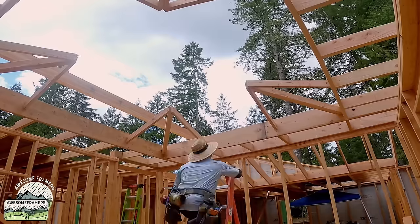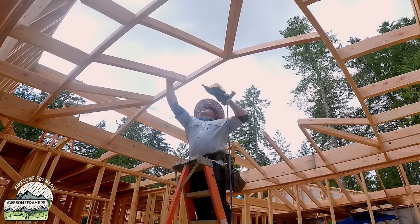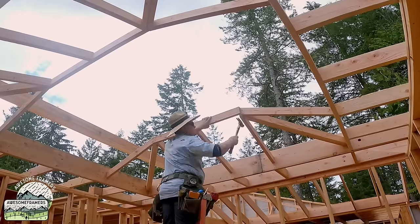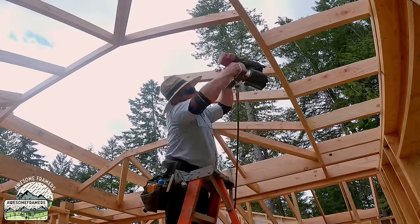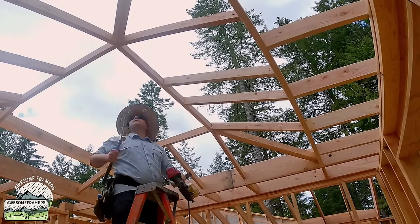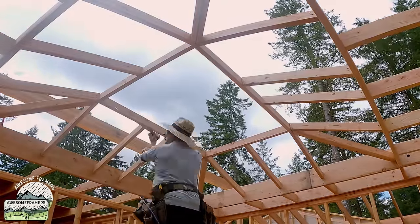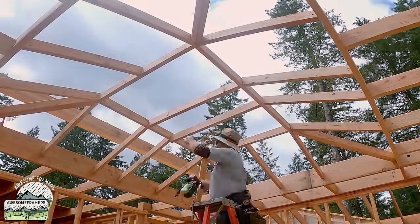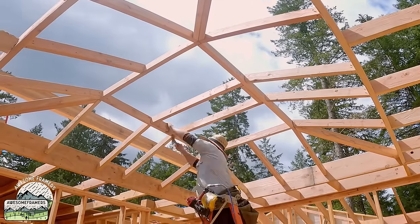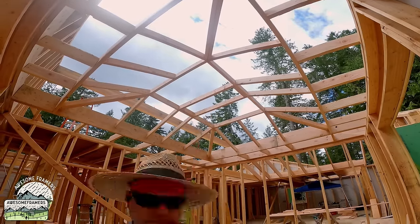Kyle was off for the day and everything was too heavy for me to do, so I framed the master bedroom ceiling. We call this a hip tray, easy one-person work. All of the components, the rafters, the hips, are pre-cut on the ground out of just 2x4, and then measured to fit in the upper part of the ceiling. We would wait for dry work or undercover to do this, but it was easy for me to do, and it did give us a nice spot to balance our big 2x12, 24-foot rafters. Plenty strong enough.